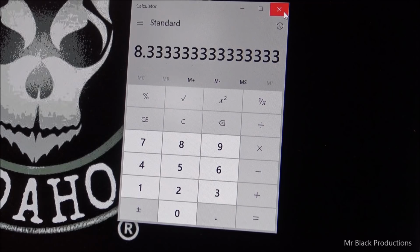They're going to want to know how to get a hold of you. They're going to want to know your email. They're going to want to know this, and they're going to want to know that, which is going to be your basic contact information. Then they're going to ask you what you're looking for. So you're going to tell them what your primary voltages are. Otherwise, what voltages are you going to feed the transformers? 110, 220. You're going to do 3-phase. It doesn't matter what the input voltages are. You have to know what your primary voltages are and what your secondary goal is.